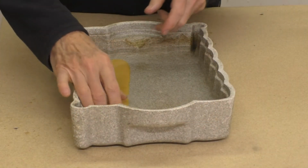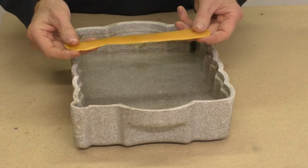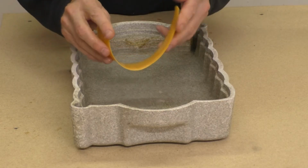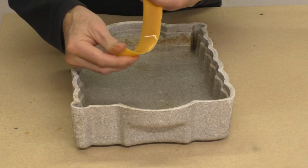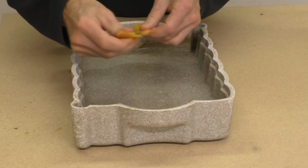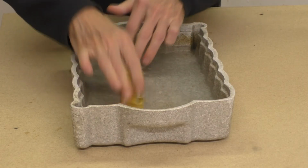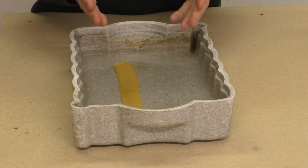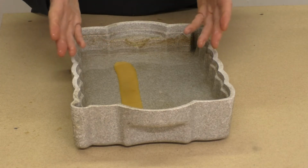Before we move on, I want to talk about one more thing around moisture and PVA glues, and that's about the PVAs that are rated waterproof. So let's look at that same demonstration with just the PVA waterproof type glue. So here I have a waterproof PVA soaking in water, and it's not dissolving like a regular PVA, but it's still extremely soft. I can really sort of curl, look at how I can just curl that around. So it does soften it, very similar to what happens under heat. So just to be clear, a waterproof rated PVA glue still will soften, it just won't dissolve.